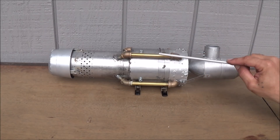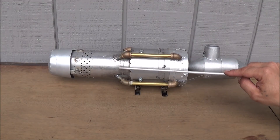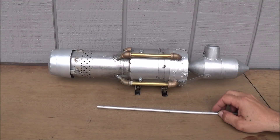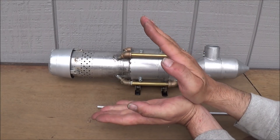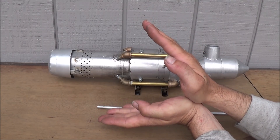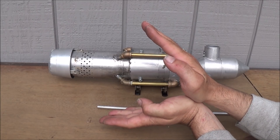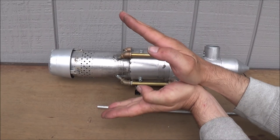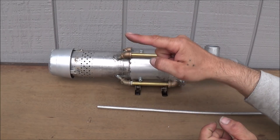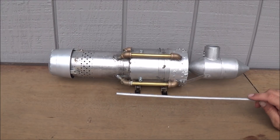Once this air is bypassed from our compressor into the ramjet, what we have is a fuel ring, and that fuel ring has a V — basically a bent metal V — just out in front of the fuel ring that creates what's called a flame holder section. All it's doing is creating a pocket, a dead air space or a vacuum pocket, behind that V channel. It's just a ringed V and that's called the flame holder, and that's going to hold the fire inside the ramjet engine.